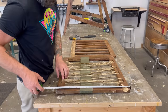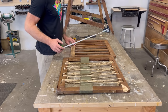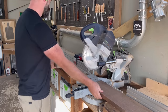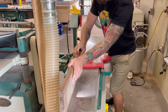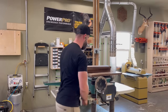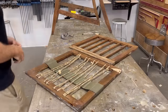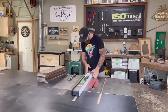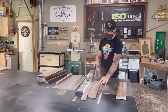I took measurements on the seat section of the old chair to roughly figure out how big of pieces I needed to chop down and mill up. With all the measurements in my head, I went over to the chop saw and started breaking down my stock into manageable pieces — way easier to mill up short boards than long eight-foot sections. I went over to the jointer and edge jointed everything, then face jointed it. Once I had two perfectly square and flat sides, I ran everything through the planer to get a third flat side. Then I re-measured the seat section to get the correct width — right at two inches — and set my table saw to rip pieces down.